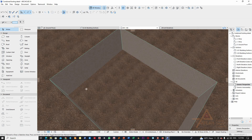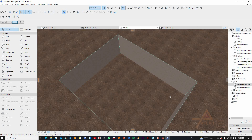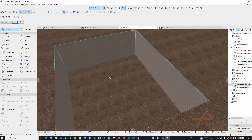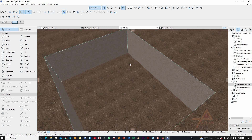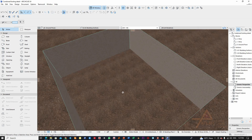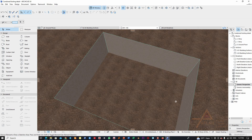During the alignment or setting out procedure, you will locate the corners of the footing pad. Accordingly, you will add some space for putting the formwork panels. These locations here represent the location of the combined footing, and accordingly we will put the lean concrete before placing the reinforcement and the spacers.